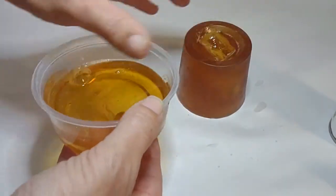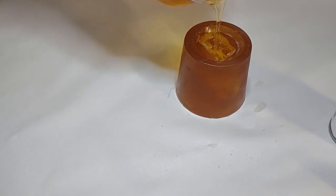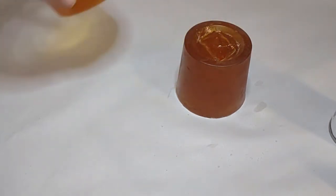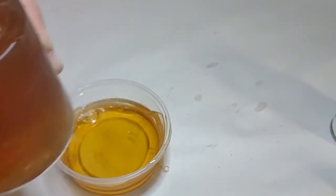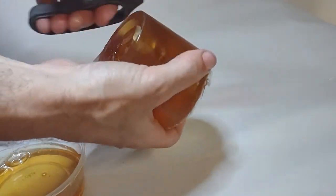Let the composite mold cool to about 130 to 135 degrees Fahrenheit — so it's almost about to start to solidify — then pour it in and it will take less time to solidify into a rubber casting. We're showing the metal casting process using a lost composite mold process, but the same approach also works with beeswax, soy wax, or pretty much any type of wax. We're calling it the lost composite mold process, but it would equivalently be called a lost wax process. Either one will work.